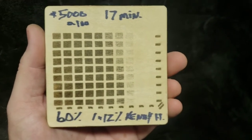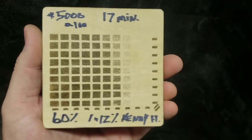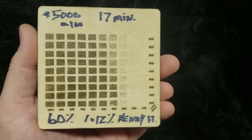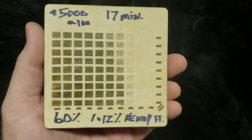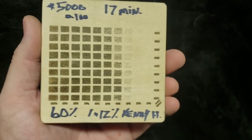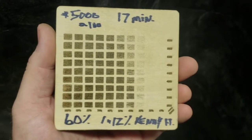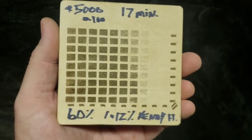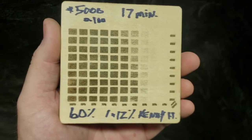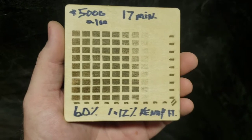Today I'm working on wood with the Kenny Hack. This is a standard materials test pattern you can find on the Lightburn Facebook group, except it has been modified. Instead of 600 to 3,000 millimeters per minute, I've got it ranged from 2,800 to 6,000 millimeters per minute, because with the Kenny Hack's solution it's so much more reactive to lasers — it can just run phenomenally fast.